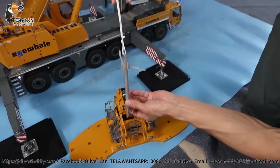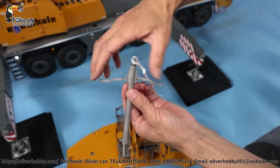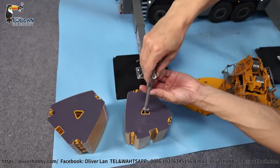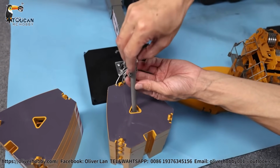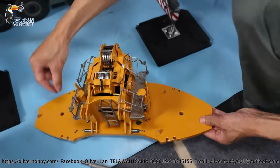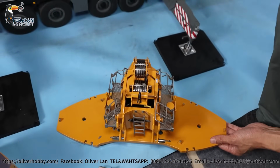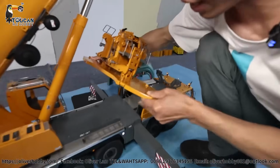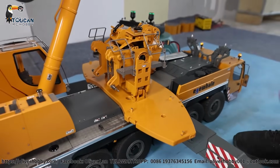So now we only have this rope and this lock mechanism. This one is only for simulating manual turning, yeah. So only secure on the top. So push in, turn it, you will be able to lock and lift up. But now there is no rope to lift up this seat, so actually you can have 4 ropes, one here, one here, one here, and then at the top lift up by the crane to put on the seat on the middle of it. You see they have holes there, so align with these 2 pins, put in position. Then we can put the weight block here.